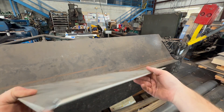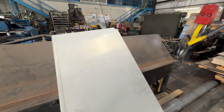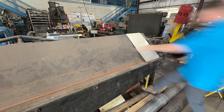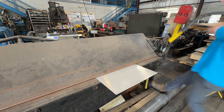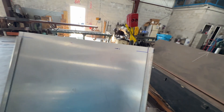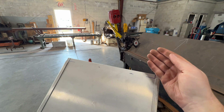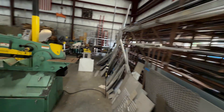I might have to mash it a little bit more. Sometimes in this process, if it's not a perfect sharp 90 degrees and it doesn't mash perfectly, it'll fold over a little and it'll shrink or grow — so you just have to keep track of your measurements. I forgot I've got to notch it one more time and cut that little notch out so when I fold it over it misses this and we don't hang up on it — pretty simple.